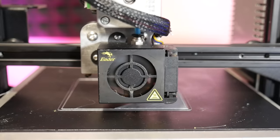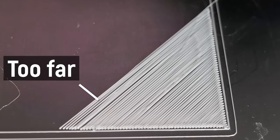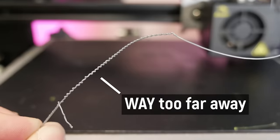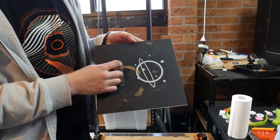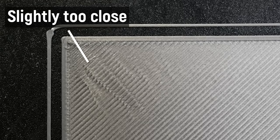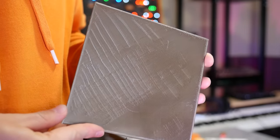Here's an example of a print that's a little bit too far away. You can usually tell because the layers come out looking a little bit stringy, not joined together nicely, and sometimes even wiggly — that's when you're way too far away. And if you're too close, you might dig into the print surface and damage the nozzle, or you get weird artifacts as it's squishing material out of the way because it doesn't have enough room to extrude correctly.